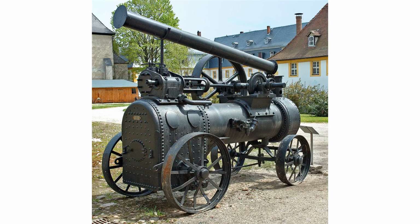The first boilers of this form had raised fireboxes that were considerably larger, particularly higher, than the boiler barrel. In the extreme case, this gave rise to the haycock boiler, where the firebox was raised into a vaulted dome. In most cases, though, the firebox was merely larger by the width of the internal iron framing section.